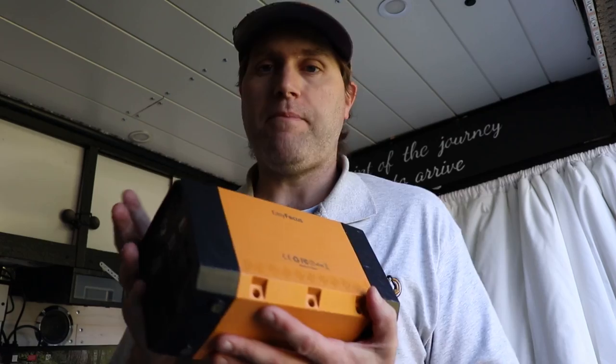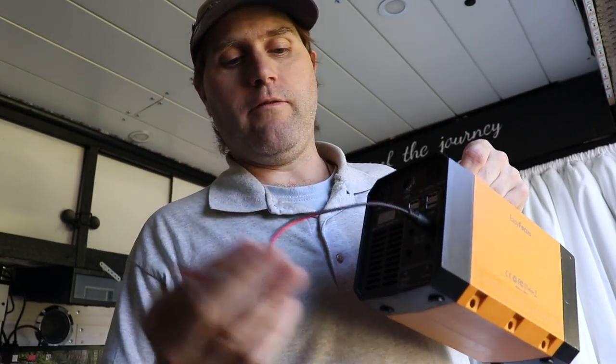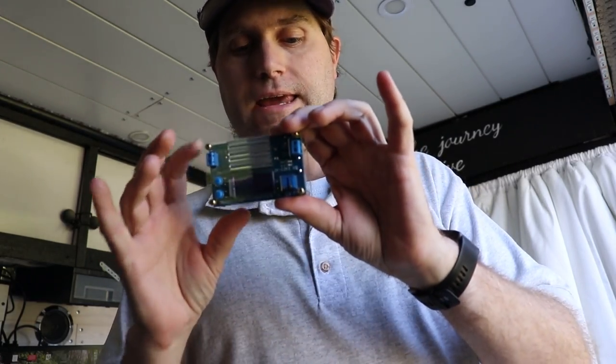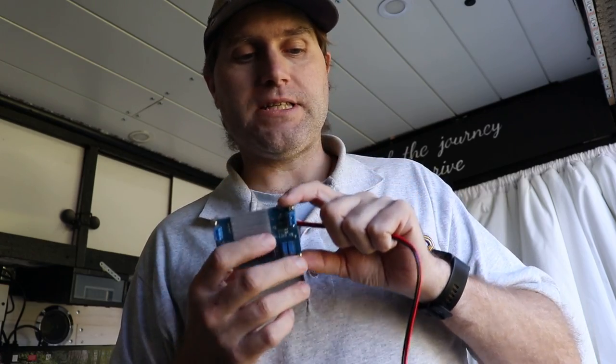So what I'm going to do is use my portable battery pack, since this is a temporary fix. It has 12-volt 3-amp outputs on the front. The idea is to use one of the male connector components, plug it in, run 12 volts through the input line of the converter, put a male output connector on the opposite side, then adjust the voltage down to eight volts at three amps. That output should then plug into the back side of my camera adapter, allowing me to run my camera off battery until I get a new AC camera adapter.